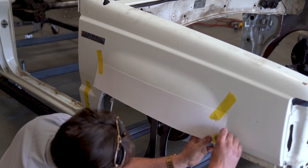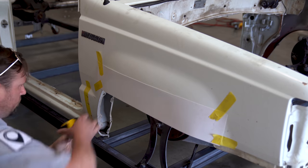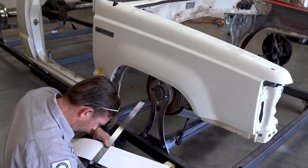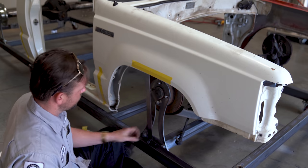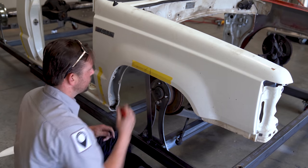That gets a little tricky because we have a couple of different radii to deal with and no flat section, so the only solution is to grab a piece of poster board and trace it out. Since I'm working with a perfectly leveled jig, I can trust the measurements I get off of it. Once I get the poster board in place with a straight edge facing down, I can hold it up at level and verify the measurement with a tape measure based on the position of the jig. After tracing out the inside, I can take a measurement from one side to the other to figure out where my center is, draw a line, cut it out, stick it back up in the fender, and translate that center line onto the fender itself. Then I grabbed a digital protractor, set it at exactly 90.0 degrees, and measured the difference between the center line of the axle and the center line of the fender, which tells me how far forward or rearward I need to move the body. It needed to go an inch and a quarter to the rear. Be extremely, ridiculously picky about your measurements - go over it a thousand times until it's dead on.